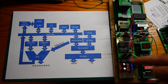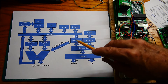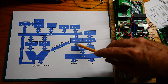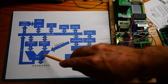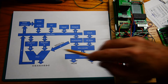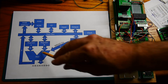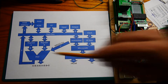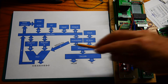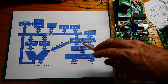One thing you're probably not familiar with is there are four bits from the instructions. Four of these bits are sent to the ALU: S0, S1, S2, which tells the ALU which one of eight different operations to do, and then carry in. Those are tied to different bits in the instruction, such as carry in is the lowest bit, bit 0.